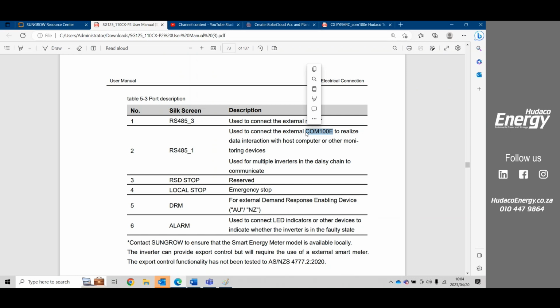The reason why the diesel generator needs to supply 30 to 40% is so that it's working. Those diesel generator motors are designed to work hard. If they don't work hard, then we get a thing called piston glazing. That's when it's not working, it's running in freewheel, and that's not good for a motor that's been designed to work hard. It's almost like these big Caterpillar trucks pulling loads from one province to another. It's not good for those trucks to run without a load.